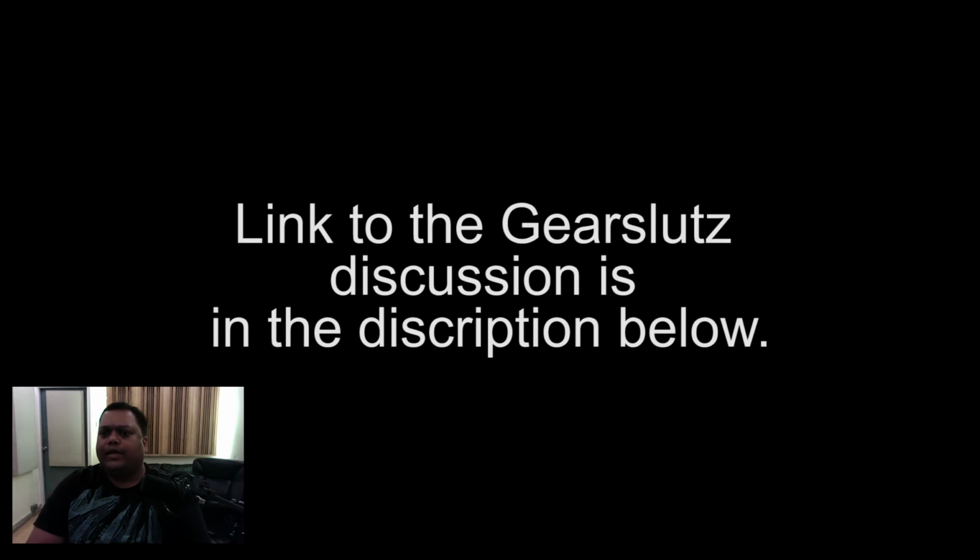There is one particular post on Gearslutz which pointed out a specific issue with a capacitor that is located somewhere near the push-pull transformer driver. The device has a tendency of getting a lot of heat from the nearby components, resulting in the capacitor failing at times, and at times not entirely failing, but just causing a lot of issues with the output. So I thought, let's give it a shot, and that's what I did.